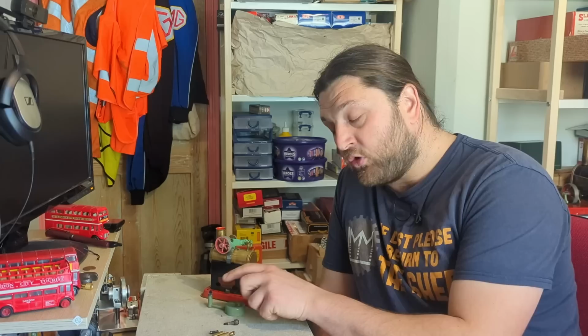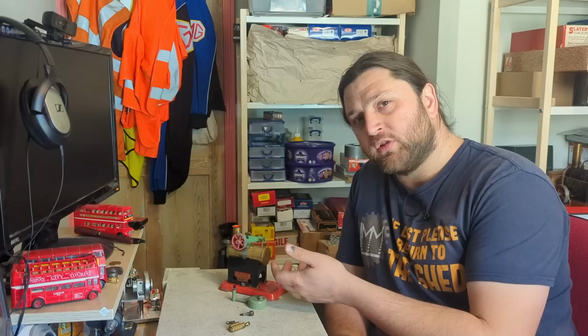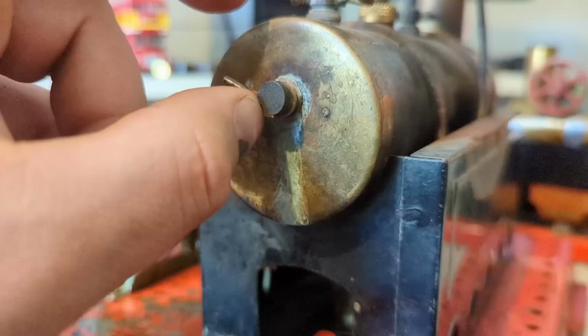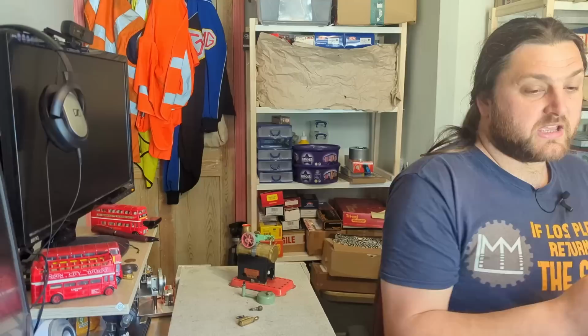And I hear what you're saying. Well, there's no real system to see how much water you've put in. Do you measure it? Or, like some other engines, like my steam engine 3, SE3 here, you have a gauge three quarters of the way up, so you keep filling the thing up until water comes out of there. And then you know that on this engine, you have three quarters of a boiler of water, which is the correct starting place. Which again, is something that I really dislike about this one, as there is no way to tell because you just fill it from the top.